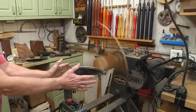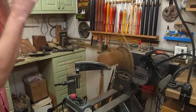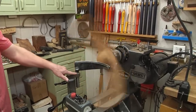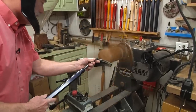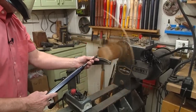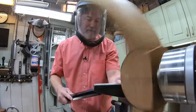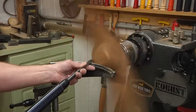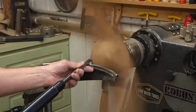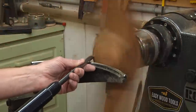I feel a little shake there, so I'm going to come down a little bit. I've got this big blade right here going, so I'm going to keep myself right in here. Robust sells these great box rests that are curved, and I'm using a dogleg to stick out even further so this won't hit the banjo. So now you come in here, take a deep breath, and just gently start cutting. Just make a little bit of contact — you can see why I want a small point here, just to make light touches. I'm going to work on this for a bit and make the bottom of the bowl shape almost to where I want it, leaving it a little bit thick.